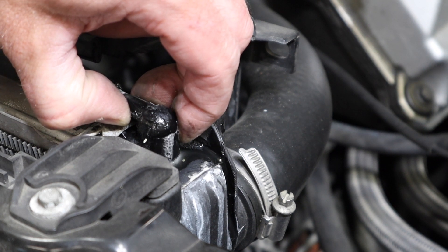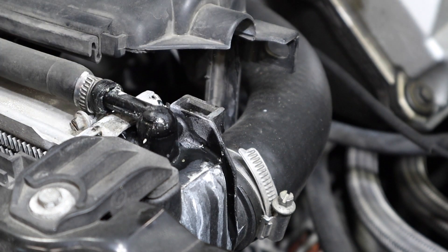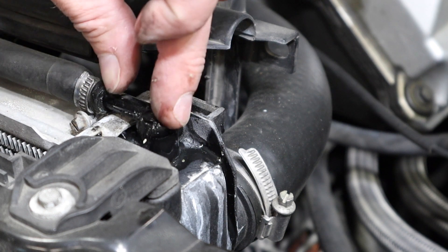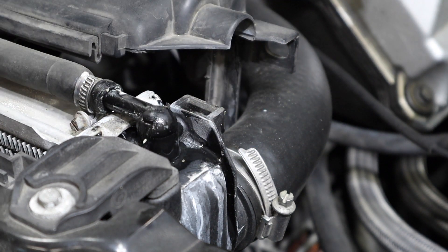With just a little bit of flexing we've got a leak at this corner. When you have a consistent leak it looks like this — air, liquid, or a combination of the two coming out. Then I would go about looking at a parts diagram and figuring out whether this upper piece is serviceable or if it's part of the end tank so that I could get that repaired.